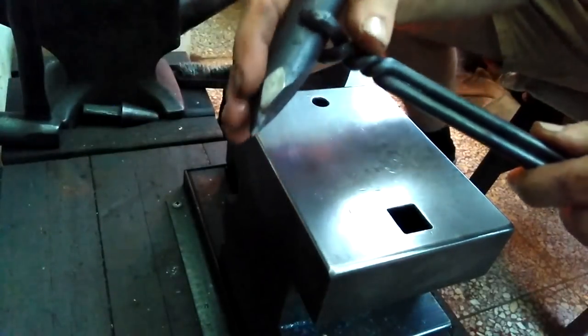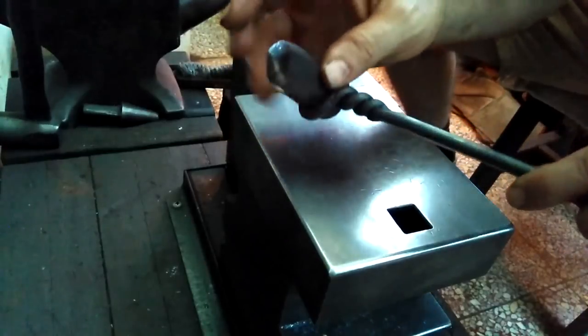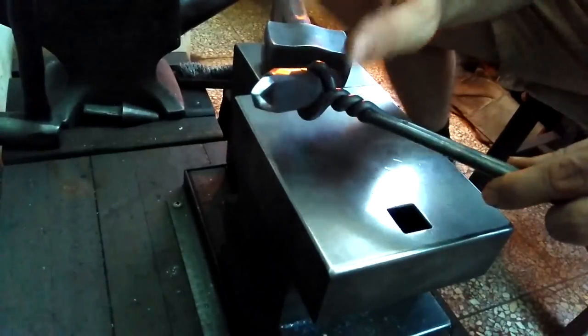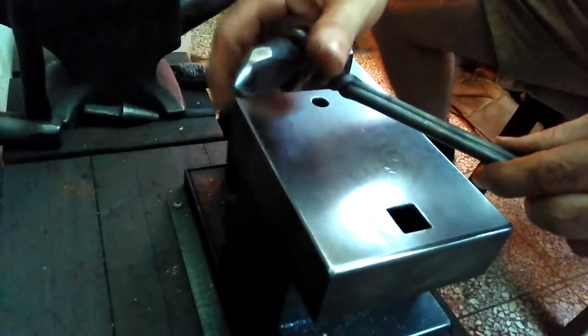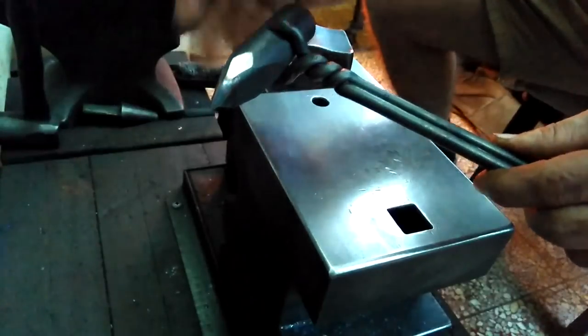Using this type of air hardening steel, if I have it in the hole for a while and I take it out and I see color on this end, don't quench it then. You'll over harden this type of steel and it'll be brittle. But if it's at a black heat, it's okay to touch it quickly into your slack tub to cool it off. And like I said, in my personal opinion, it helps keep it in better shape longer.